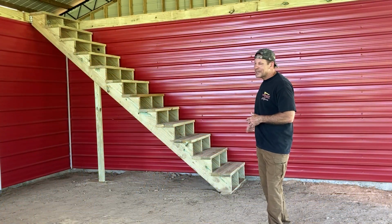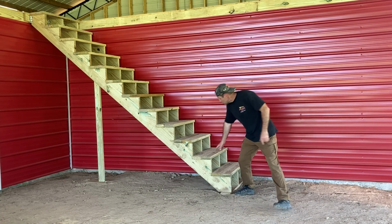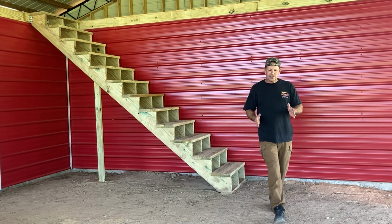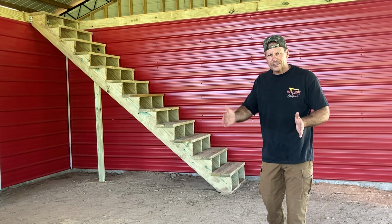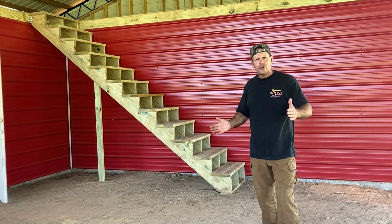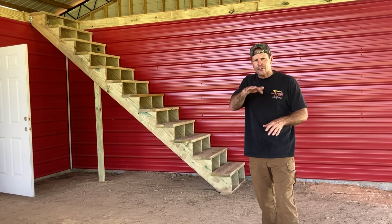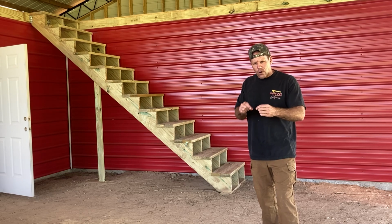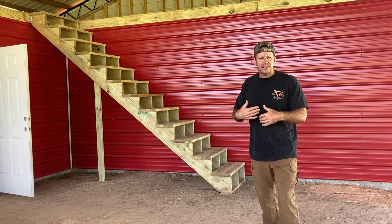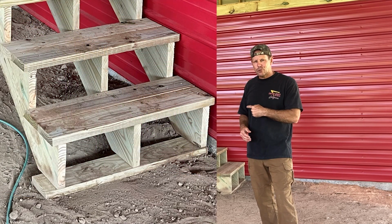And you see 3 16-foot 2x12s there, because they originally were going to do 2x12s for the steps. And I said, no, let's use 2x6s. They're cheaper, and I like the look better of 2 2x6s instead of 1 2x12. I figured a 2x12 step would hold dirt, would hold grit. Sometimes they're concave or convex. They won't sit flat, and there wouldn't be a crack or a gap that would allow the sand to kind of filter down. It saved us $400 by using 2x6 instead of 2x12 treads.